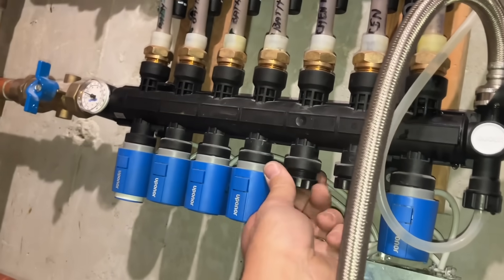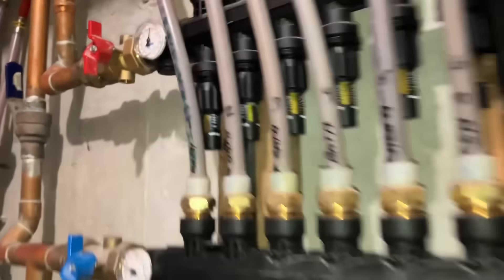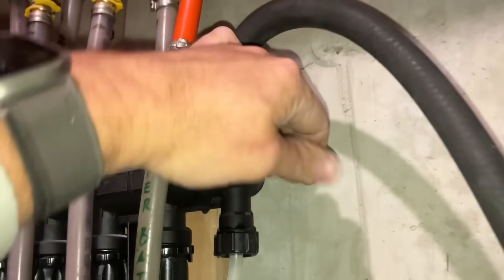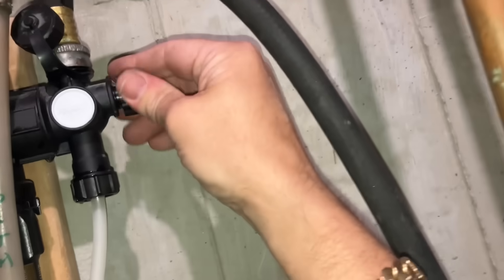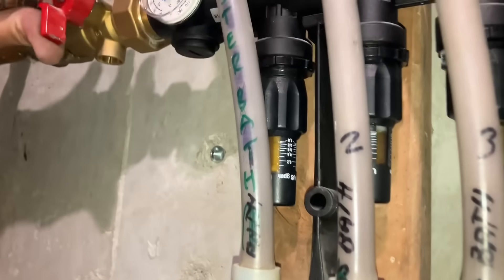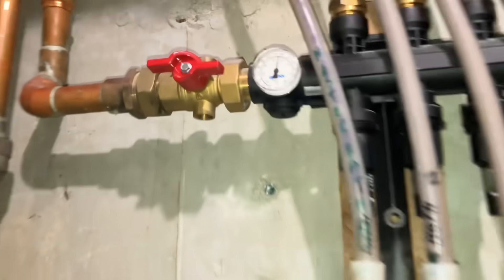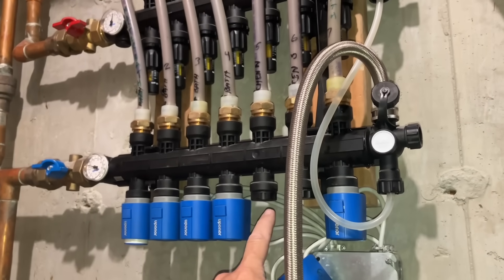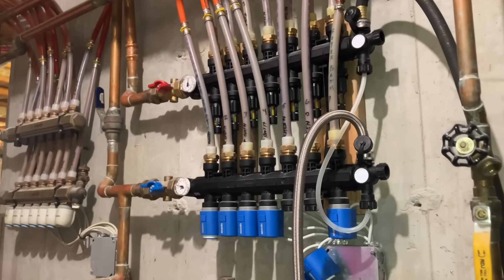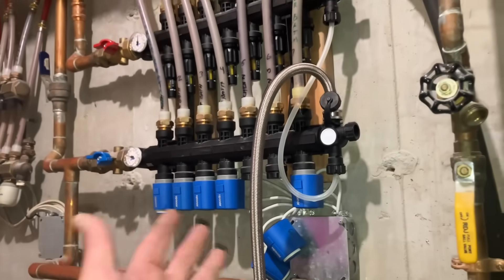Let's get the other kitchen loop shut down too. Great flow there. Let's close our drain, keep pressure in there, and close our incoming water — no flow. Let's pop open that one and that one — and now we're back to 0.4 on flow. So opening up two more loops decreases flow across all of them, especially the zone we're working on. We've still got a restriction there. We've got plenty of flow from our circulator, but we've got a restriction, and water takes the path of least resistance.